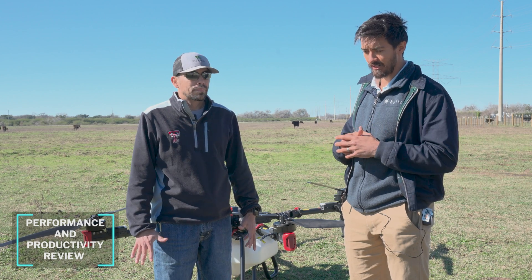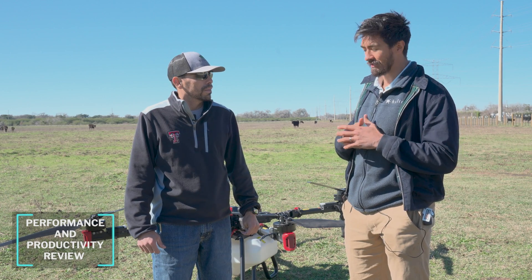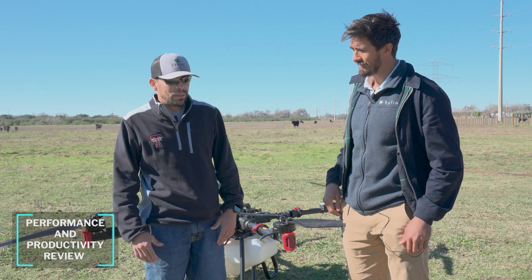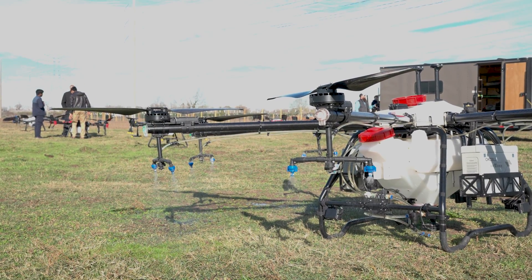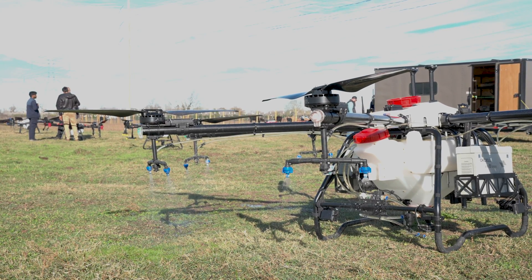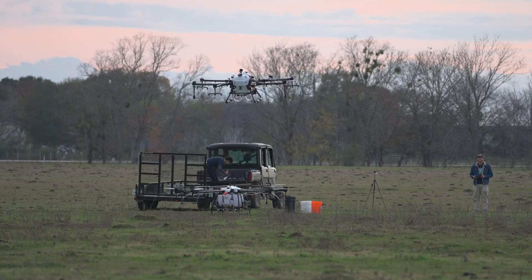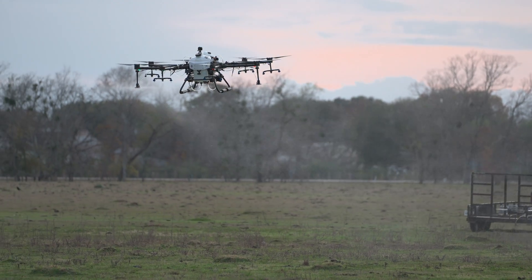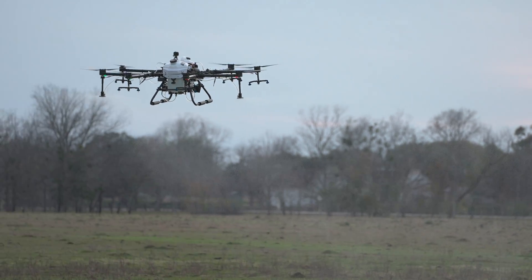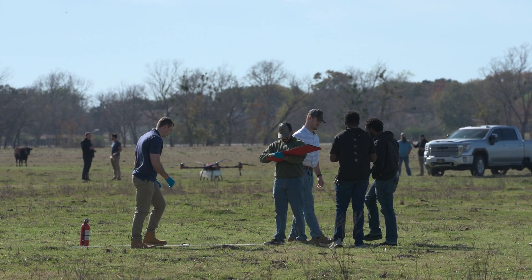Just generally speaking, what are your thoughts about how they performed — were you seeing what you expected from the atomizers and hydraulic nozzles? Even though we had a somewhat windy day on our spray trials, looking at spray patterns and spray quality, I was still very pleased with all the drones. Even specifically the atomizers — the 272 with the atomizers performed outstanding. It did surprise me that we saw a little bit better results visually with the hydraulic nozzles, but there could be a bunch of different variables.